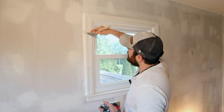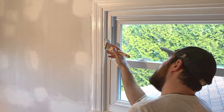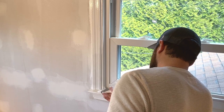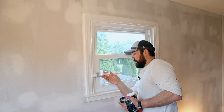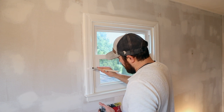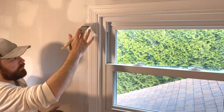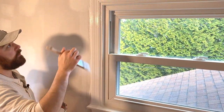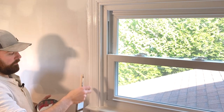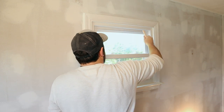I'm going to start here and come around to cut the clean interior line. You might not be able to do it as quickly — that's okay, take your time. If the whole window is wood, you don't even have to worry about this and you'll just be painting everything. When you're painting trim, you want to go with the grain, and you want your brush strokes to be feathered so it looks like one long clean brush stroke, not a bunch of little choppy ones. No lap marks or brush lines — just one clean feathered stroke from top to bottom, going with the grain of each piece of trim.